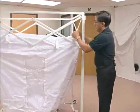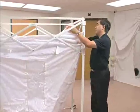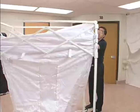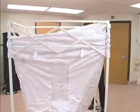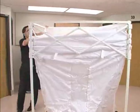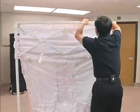Once the envelope straps are connected, we take the top piece of the envelope, which is a liner of velcro stitched into the top, and connect it to the frame. This top piece prevents any debris or dust from within the ceiling tile envelope — when accessing the ceiling cavity — from dropping into and getting outside the envelope frame. The velcro holds the envelope and creates a top seal, holding at high tension to keep the unit deployed.